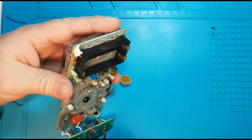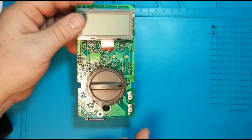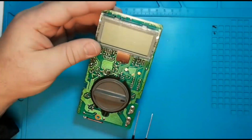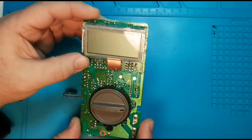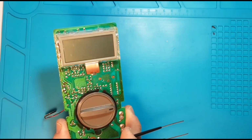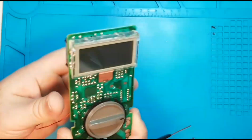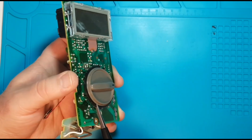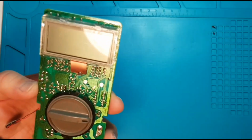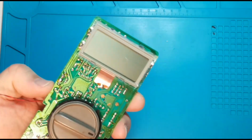As well, here you see they glued the crystal oscillator. I'm also going to take Q-tips and clean the control knob. And I will probably apply some DeoxIT just to help improve the contact, keep out the corrosion, what have you. I'll apply that just underneath here to the chassis as well. It's a really great product. So we're just going to go after this little guy and clean it. And I'm debating right now whether or not I'm going to clean that LCD display.